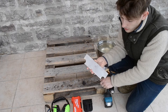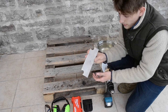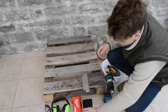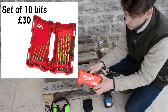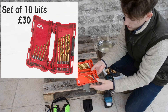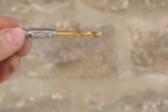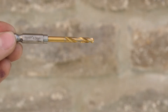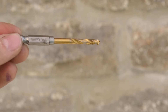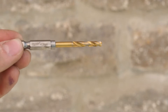Now the hardest part about drilling through stainless steel is drilling the pilot hole. For that we're going to be using some special stainless steel titanium plated drill bits. I'm going to be using a 4mm drill bit. You need to use a pilot hole whilst drilling metal, as if you don't and try jumping straight to the size drill you need, then you're more than likely going to blunt the drill and fail in the process of drilling a hole.